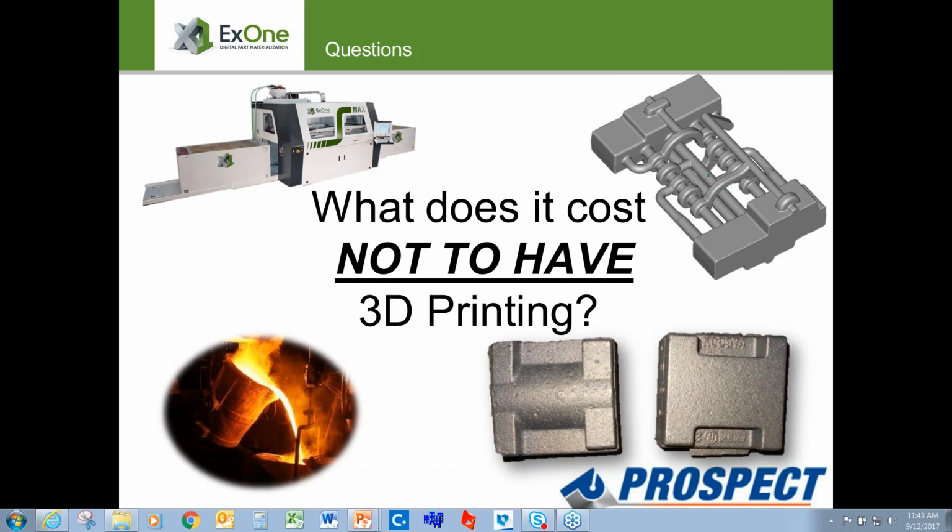And certainly coming from your mouth means a lot more than coming from the salespeople, right? But what we have found and observed is that the shelf life of our furan molds and cores is actually very, very long. We've cast cores that have been sitting around for 6+ months, and as long as it's in a cool, dry environment, there is a little bit of a chromophoric reaction where the cores, which are normally green right out of the machine, can have a little bit of a yellowish tint, which is typical when the UV light hits the cores over a period of time.